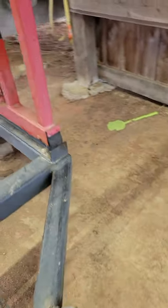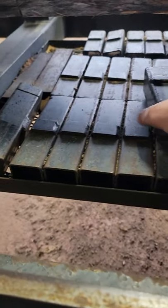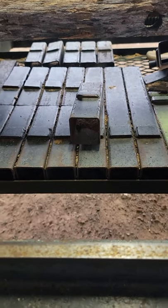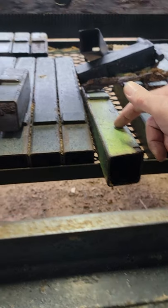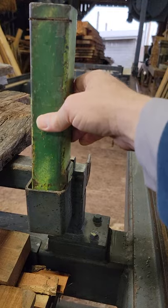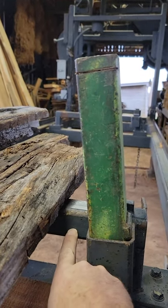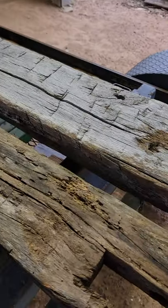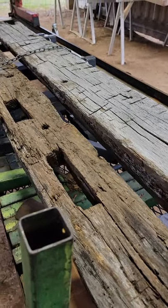For clamping logs, there's a whole series of clamp tubes. Something about this tubing - when you set this up, some of this was an afterthought on the lengths. But you'll want to use the same batch of tubing for all your clamps. The reason being is when you put this in here, it's got that stop so it goes down, and when it's tilted all the way this way, it should be exactly 90 degrees to this tube right here. Over here I had sold some barn beams for a guy - these were some pieces that got cut off, just these old barn beams with notches for different things, still with a piece of a dowel that helped hold it all together.